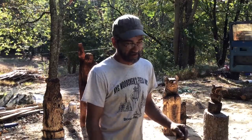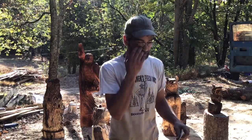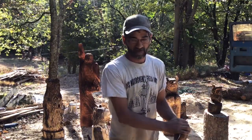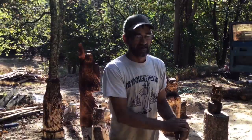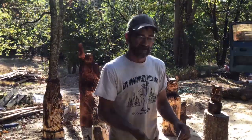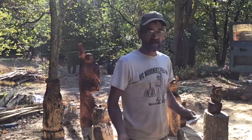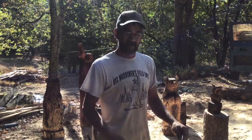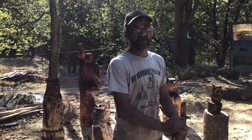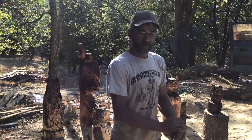Chaps. A lot of the shows that I do, they require you to wear chaps, and that's fine, I'll wear them. If I'm carving on my own, I don't. Now, I know there's a huge concern that I could hack my leg off, but when I'm wearing chaps, the legs are stiff, it's hard to maneuver, it's hard to see. I feel like there's probably a safety issue in that, because you're running so much hotter. You can suffer from heat fatigue and that sort of thing. So I don't wear chaps when I'm carving at my shop.